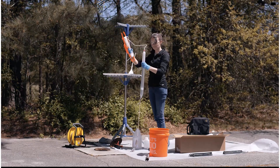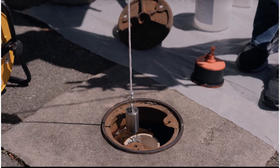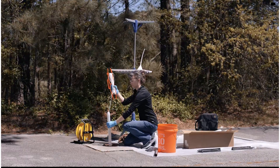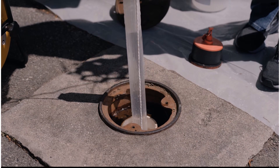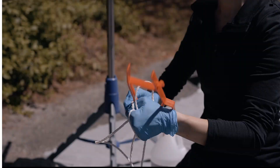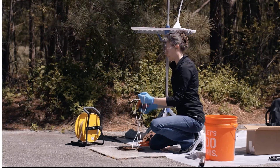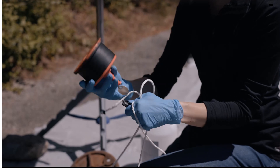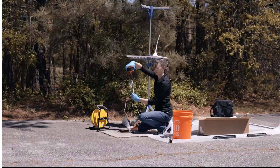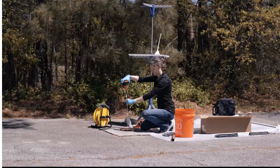To install the dual membrane PDB in a monitoring well, continue holding the sampler with one hand and take the tether spool in the other. Center the weights over the well and slowly lower the tether into position. To prevent losing the end of the tether down the well, wrap the tether around your wrist before unspooling all the tether. When the tether is almost unspooled, remove the tether from the spool and secure the snap connector to the bottom ring on a well cap. Continue lowering the tether and place extra tether inside the well so that nothing is between the well cap and the casing. Place the cap securely on the well casing and tighten. The line should be nearly taut when the well cap is in place.